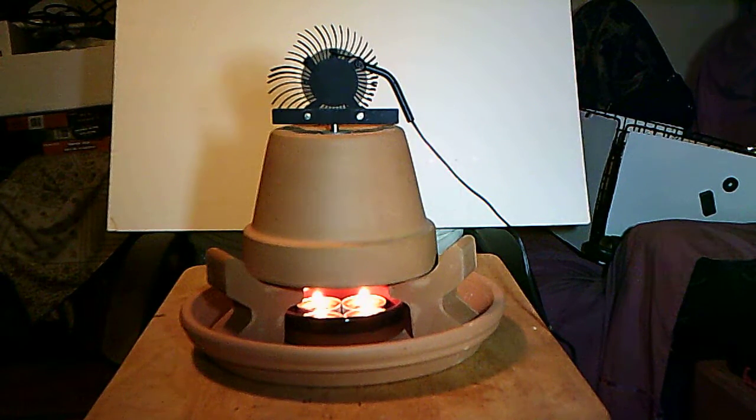Hello YouTube, this is another video on the candle heater that became quite popular a few years ago. After messing around with them in different variations, we got to satisfactory results. Now let's say what it is and what it isn't — if it's cold and freezing and you have one of these, you will freeze to death. It will augment heating a room. The room it's in right now is 12 by 15, and using the thermostat set at 65 degrees, it will help maintain the room at 70-71 degrees. We've tested with and without the candles and it raises the room temperature overall between 2 and 3 degrees, and reduces the cyclic rate of the heater coming on and off.